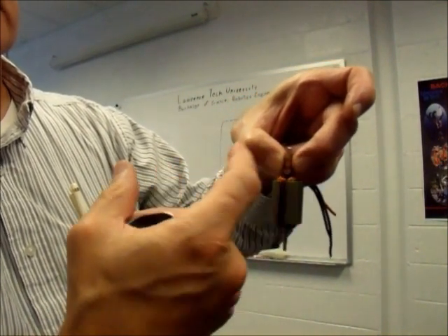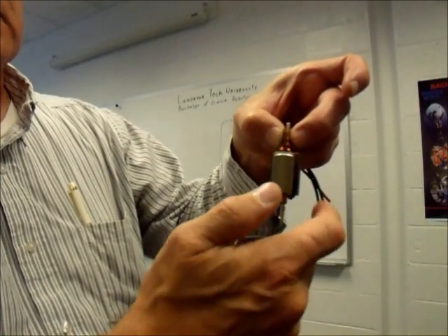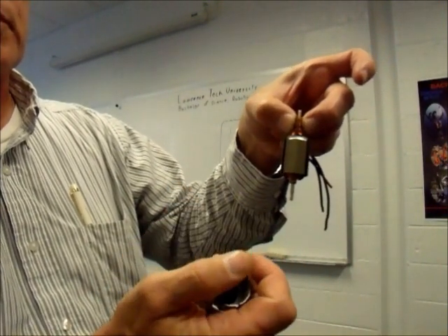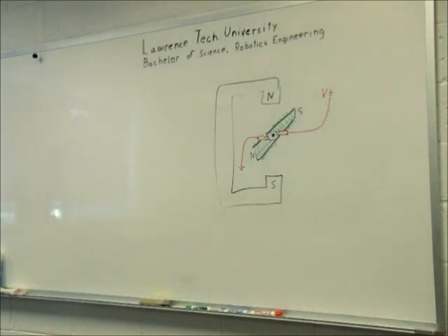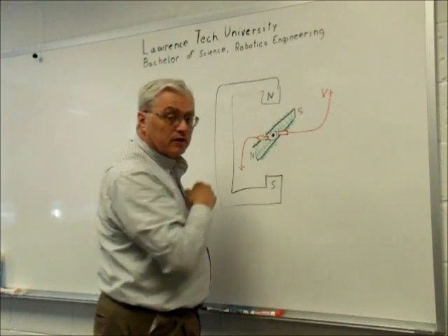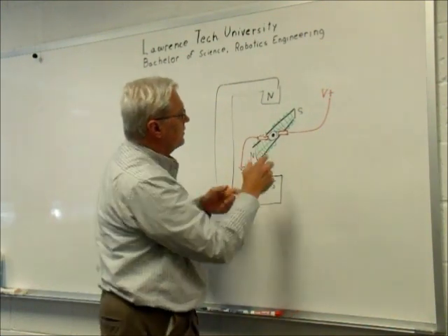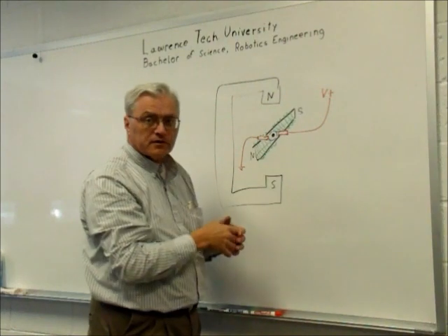The orientation of the magnetic field relative to the brushes stays relatively constant, so we have a magnetic field that rotates relative to the armature but is constant relative to the permanent magnet. It's the relationship between this generated magnetic field and the permanent magnet's field that causes the motor to rotate. On the board I have a simplified drawing: the permanent magnet, the commutator in blue drawn as two segments, the brushes in red connected to power and ground, and the windings in green on the armature. In this configuration, a south pole is created at one end of the armature and a north pole at the other, and they're attracted to the opposite poles of the permanent magnet, causing rotation.